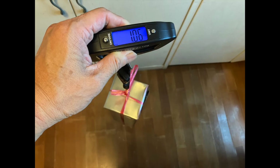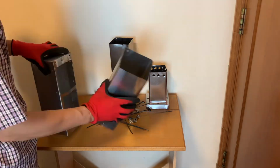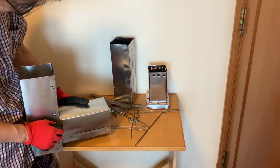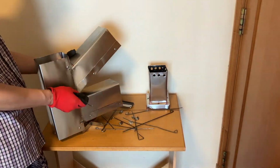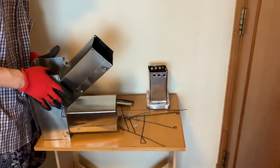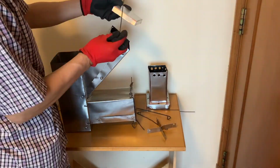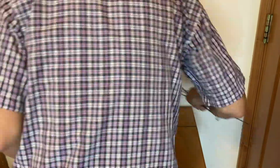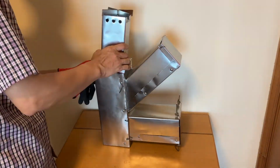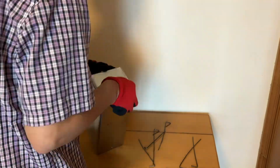The whole setup weighs around 1 kilogram. Then every piece is fixed together by the hanger wires and a small clip that I created out of 0.2mm stainless steel sheets. It's just a small piece of metal with two holes drilled close to one another, around 5 mm apart, and I bend the small clip a little bit so we can force the wire through it, and because the steel sheet wants to rebound to the original shape, there's some pressure. That pressure will hold the wire in place.